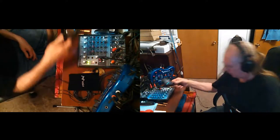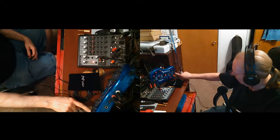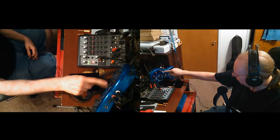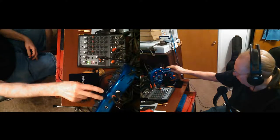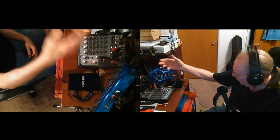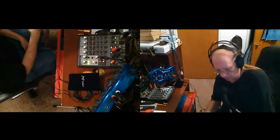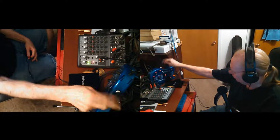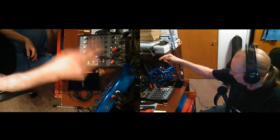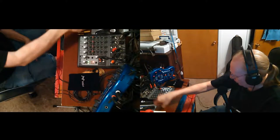Oh, two-track to control room, because the way I'm getting my, I have two outputs on my VM, the phones and the regular output up here, left and right, quarter inch. And then I use what's called an insert cable, actually. It's quarter inch TS on one end, and the other end is quarter inch TRS. And so now I adapted that over. Actually, this one might be RCA on the other end. But anyway, this goes, yeah, it's probably quarter inch to RCA on the other end. Going to my tape deck. I mean, no, this goes to the computer. Yeah, so this is quarter inch to TRS quarter inch, then adapted down to TRS, you know, eighth inch or 3.5 millimeter.